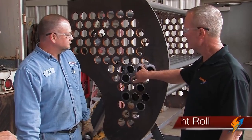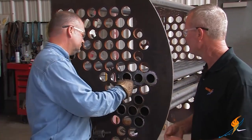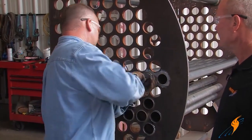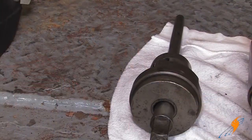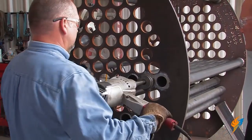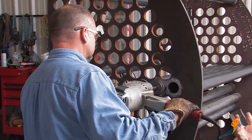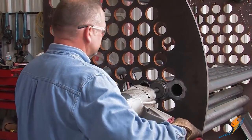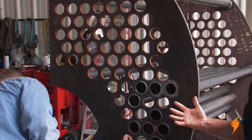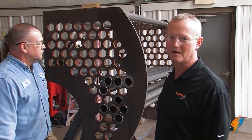What he's going to do here is a straight roll on this tube. These tubes we're going to seal weld, so you do a straight roll. First he'll oil it — get some lubrication in there so those rolls don't lock up inside the tube. Then he slides the tube in. This pin is tapered, so the further that pin goes in, the more it pushes those rolls out against that tube. You hear that motor bogging down — that's the roll really tightening up against the tube. And that's pretty much it. He's done the roll; that's how quick it happens.